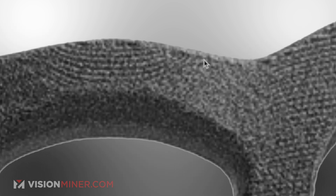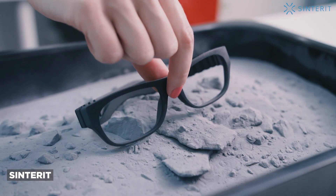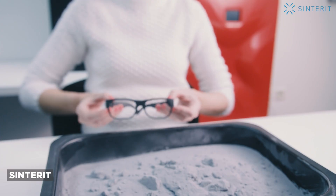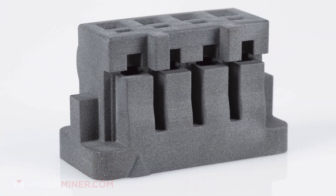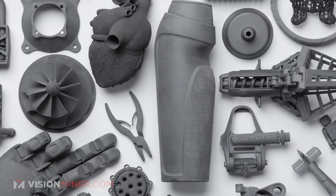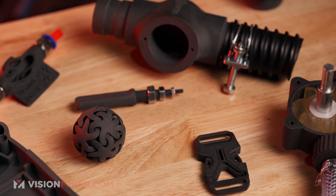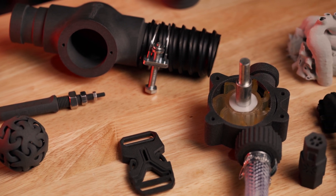You can actually see a little bit of layer lines, but your layer lines are very, very small in these machines, so you have to zoom in for that. If you're doing connectors or prototypes, robot gripper arms, vices, tooling, jigs, fixtures, etc., the higher impact strength is actually going to make this stuff last a decent amount longer than the PA12 because it can take more of a beating — it's just not going to break as easily. It's not quite as brittle as the PA12 Smooth.